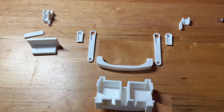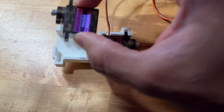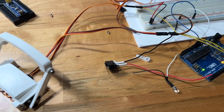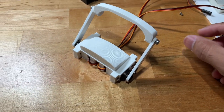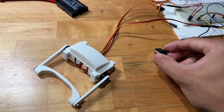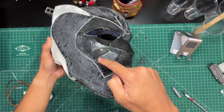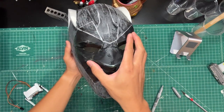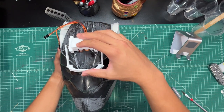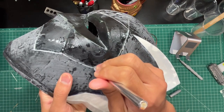Here you can see these are the pieces that are printed out. And here are the servo motors that I used — I will leave an Amazon link in the description below for all the parts. Here you can see I just snap it into that motor bracket, and after wiring it all together based on that diagram and assembling it, I got a working hinge mechanism that looks like this. And with a click of a button you get a motorized hinge. So now going back to the helmet, I'm cutting out this face plate which I outlined with the sharpie. And this is what that hinge mechanism will look like on the inside.